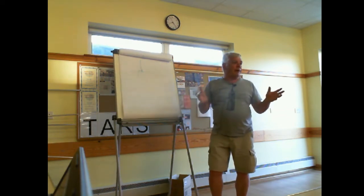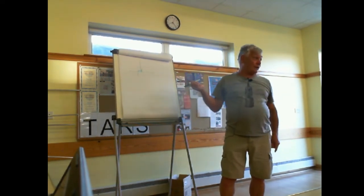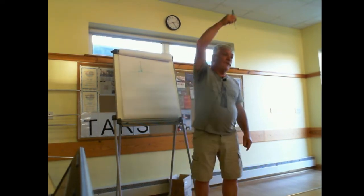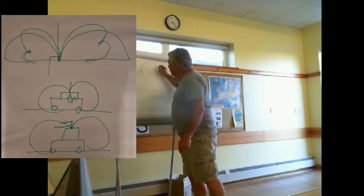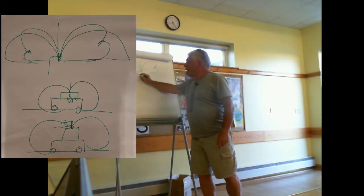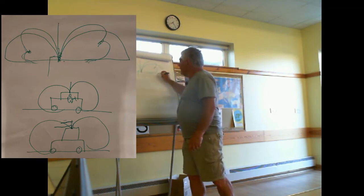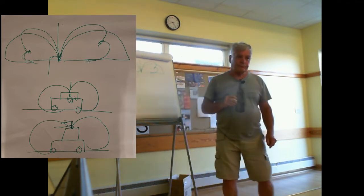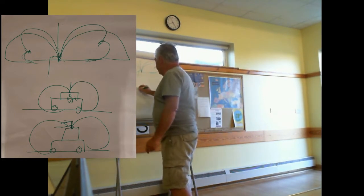One of the things that we did mention is that when we design an antenna, what are the things we need to know? One of the things you need to know is actually what antenna pattern you want out of it. Well, it's unidirectional. That's omnidirectional. It's omnidirectional in which plane? If you look down on it, it is horizontal. But if you are looking that way on, right, it will probably look something more like that. And this thing here, and that thing there, is caused by this ground plane. If it's infinite, then it just does that. If it's not infinite, you start to get these things coming in. And that's the big problem. So here we are. Oh, I did that wrong.